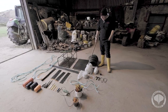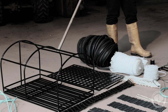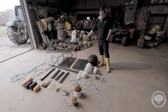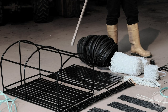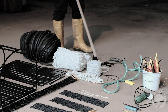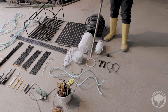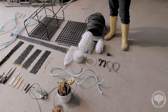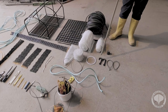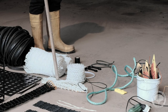Next, we have the sheeting for the parlour eye, which goes in this end of the Creel here. This is basically the nice housing area where the lobsters will sit until the fisherman comes along and picks them from the seabed. Now, the eye itself is held together with this ring here, which is a 6-inch plastic ring, and it's basically there to help keep the eye open. Also, we use these plastic hooks for the door and for the bait bag, which is over here.